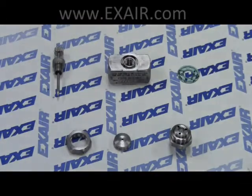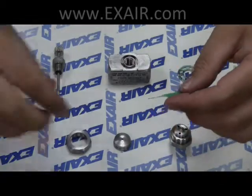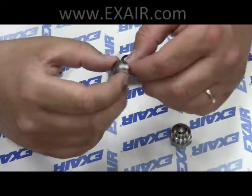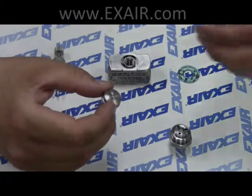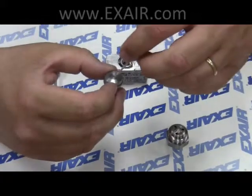If you don't have a set of miniature brushes, you don't necessarily need to run right out and buy some. Honestly, our favorite tool for cleaning these here at the factory is a bread bag tie with the wrapping stripped off. The soft pliable wire is ideal for pushing contamination from the holes without risking the damage that something stiffer, like a paper clip, could cause. Toothpicks are great too, since they won't scratch or otherwise damage the precision machined holes.